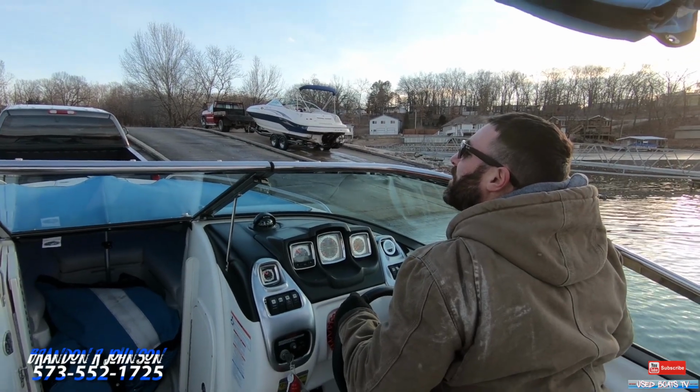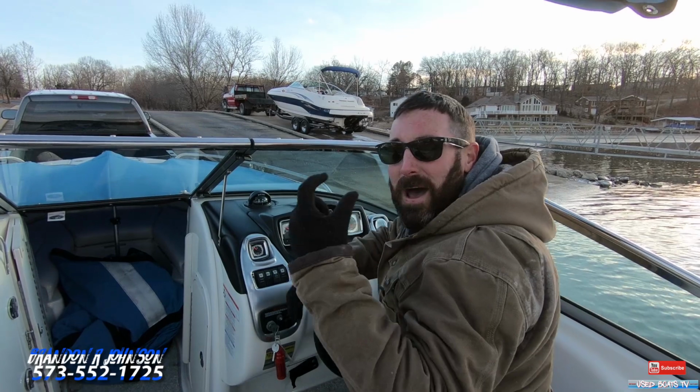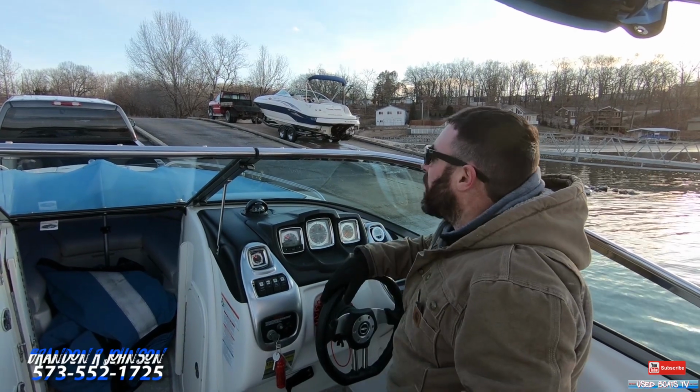Did you fall, Bill? I'm good. Right there. Now you want the bow eye, which is the hook, flush with the roller. You want it tight. Otherwise, the boat's going to buck like a Bronco on the trailer.